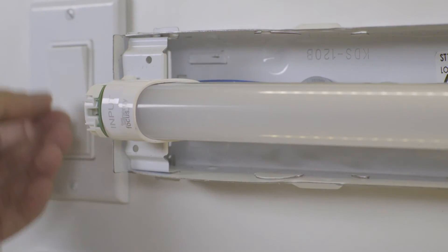A double-ended tube requires voltage on the entire tube from end to end. Therefore, if you don't shut off the electrical main power, you might be working with active ends if there are any moving parts in your system. If one of the lamp holders shorts because of the active ends, you also have to replace the lamp holder.